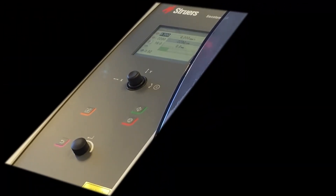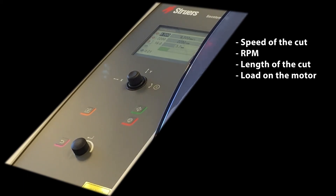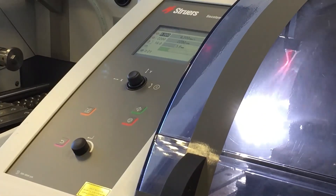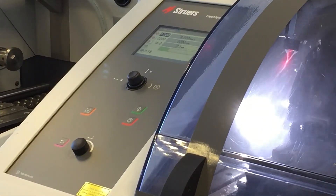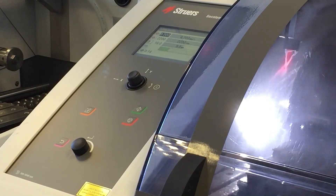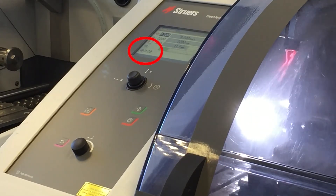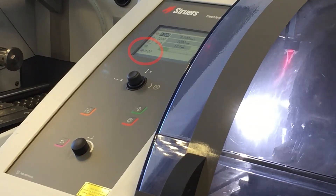Once the wheel's up to full speed it'll start doing the cuts. As you can see when it's cutting, you get a separate cut menu which shows the speed of the cut, the RPM, the length of the cut, and the load on the motor. All of the three top parameters are adjustable during the cutting process, so if you need to slow the cut or extend the cut you can do so whilst the machine is still running. It also gives you a countdown timer in the bottom left which shows you how long the cut is going to take.